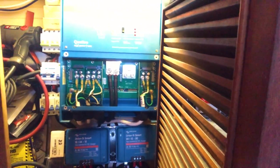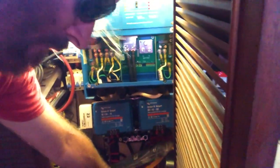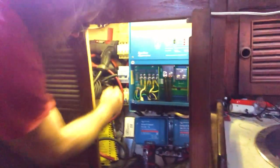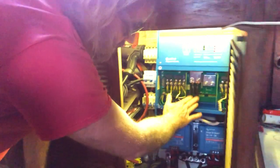So we're about to bring into play a bigger breaker. Down here, it's gonna be a 400 amp breaker for our lithium iron phosphate batteries. These are outgoing breakers. Here's our solar incoming breakers. I still gotta put in three more of those, just like these, that are gonna go right here. We got AC coming in. We gotta make these connections to our battery bank, our new breaker.